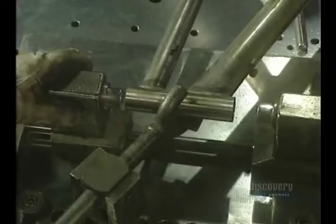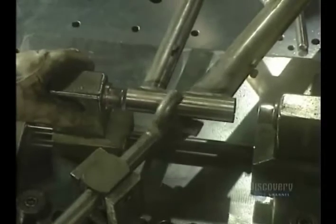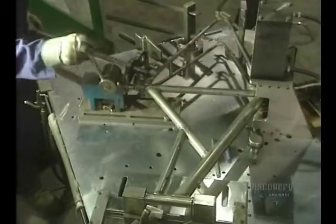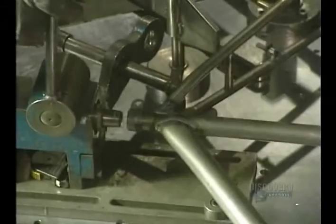At this stage, it's important to straighten the frame, which could have deformed during welding. They verify the alignment of the tubes, and they straighten it out cold with a tool that sets it to the right dimensions.